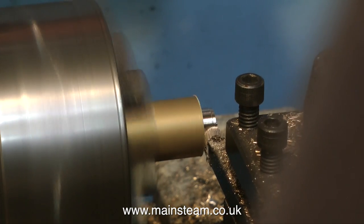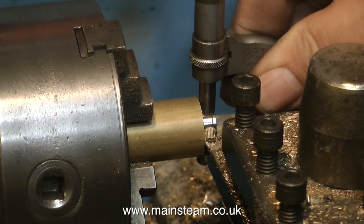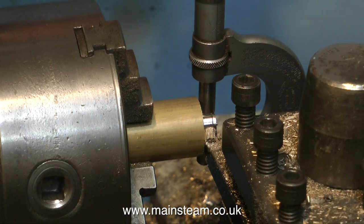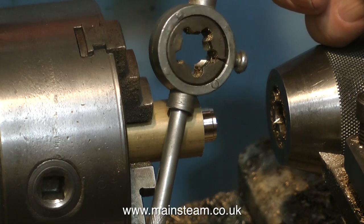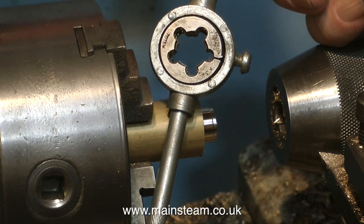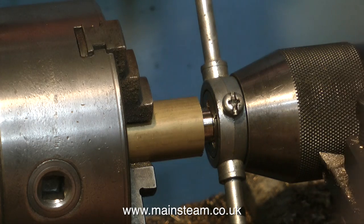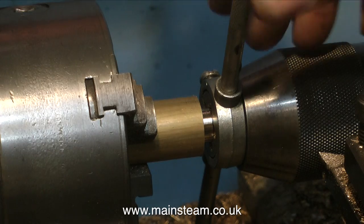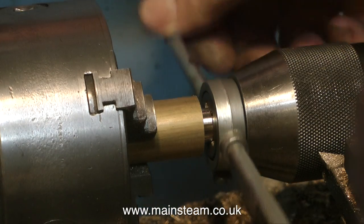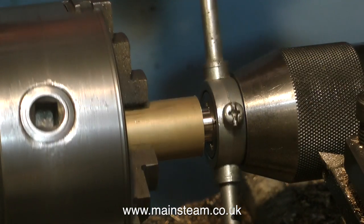That's nearly there — one more fine cut, I think. Then the micrometer fits on like this. Not a good idea — do not leave micrometers clamped to the work. Health and safety warning, protective equipment, etc. I'm aiming this next bit at people who do not have too much professional engineering equipment at hand. This is just an ordinary cheap, nasty die holder — you get these in sets and things. With the help of the tailstock chuck to keep the die in position while it starts, I get quite a good thread on this piece.